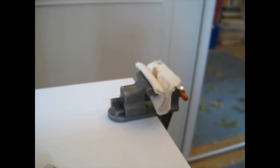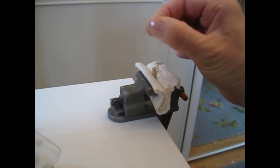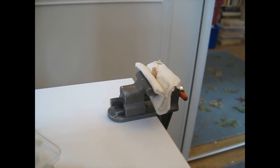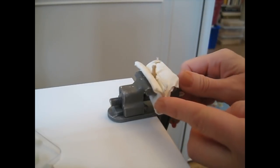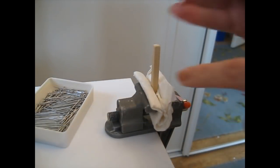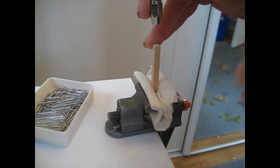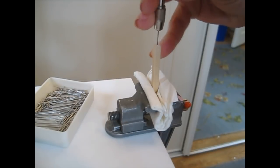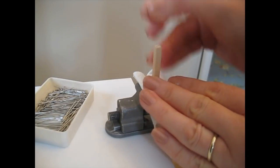To check your depth, take a dressmaking pin, pop it into the drilled hole, put your thumbnail at the top, pull it out, and you can see how far you've drilled. Do that with each of the legs, and remember to do the hole at both ends. Then do the same thing with the piece of strip wood on the rounded end — again find the centre and drill down about a quarter of an inch or 6 millimetres.